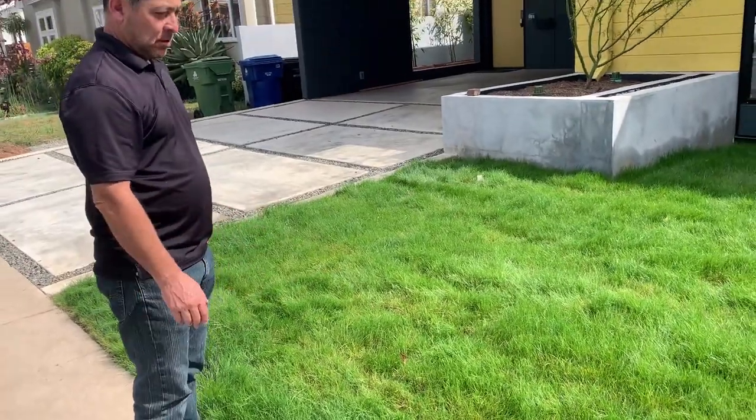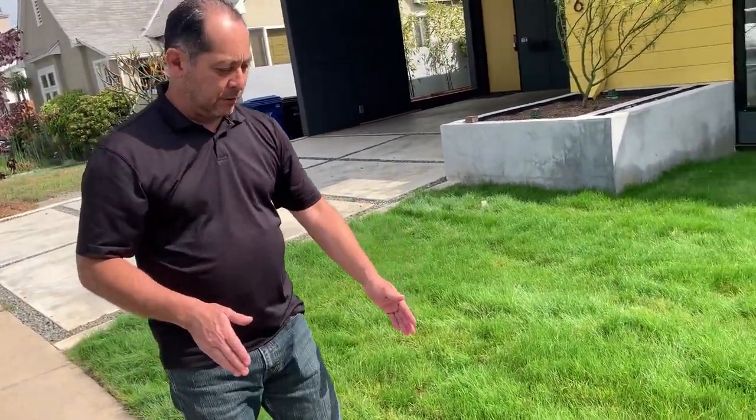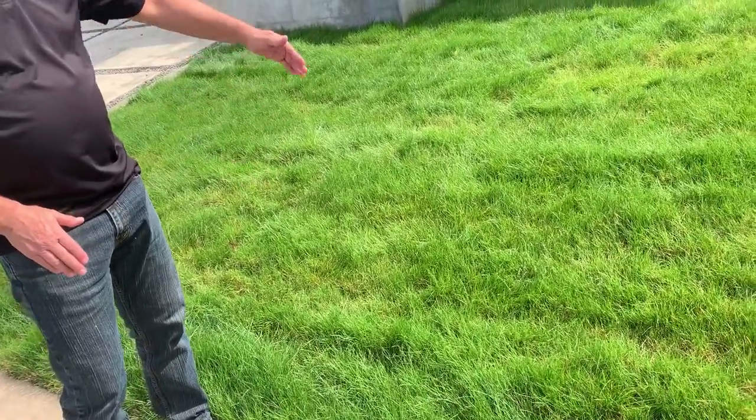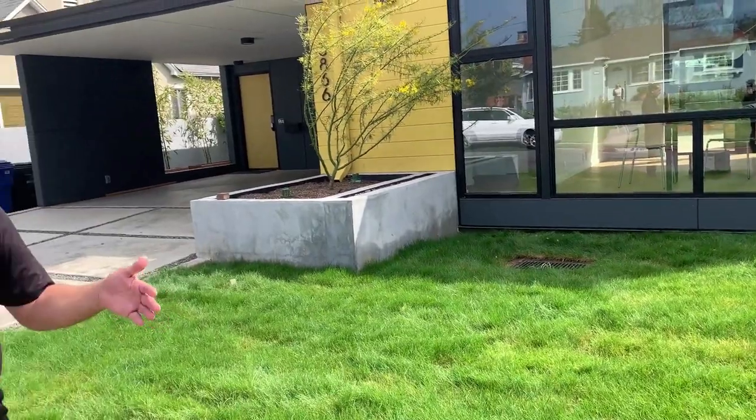Here in the front yard is a special lawn grass. The gray water system is every three feet, starting from a foot and then going every three feet across. Now whenever you have new sod you actually have to use top irrigation at the beginning to get the grass established and get it going, but then after probably about another month the subsurface will kick in.